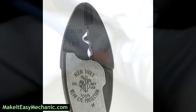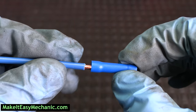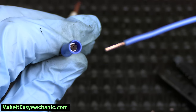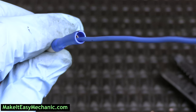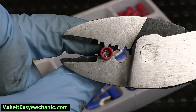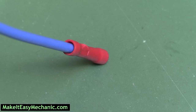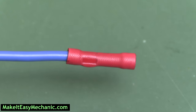Since butt connectors have a separator in the middle, you want to take off no more than a quarter inch of insulation, otherwise you will leave some exposed wire out. Once you strip both ends of the wire, pick an appropriate size connector. Common mistakes: people pick a connector too small and force it on leaving some wire strands out, or they pick a connector too large which leaves gaps creating a poor connection. Once you've found the right size, place it inside the crimping tool. Point the seam in the connector toward the valley of the crimping tool, or if there is no seam, point the separator toward the valley. Then slide your exposed wire into the connector and crimp it. What you want to see is no large voids inside the crimp, a trapezoidal shape of the connector, not overly deformed, and all strands intact. Then tug to check the crimp is secure and repeat the process for the other side.